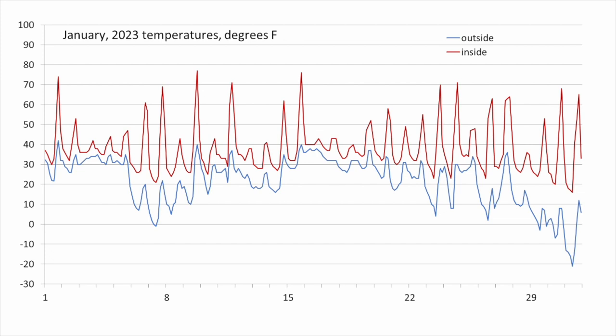It is worth noting on the graph that even when the temperature in the tunnel dipped below the 20-degree threshold at night, daytime temperatures reached nearly 70 degrees, far higher than what might be desired, and squandering heat by conduction through the high tunnel envelope that could have been stored in the ground at night. This points out the need for more heat exchange capacity in the high tunnel. Had more of the excess solar heat been stored for use at night, the high tunnel temperature probably would have been kept above the 20-degree threshold.